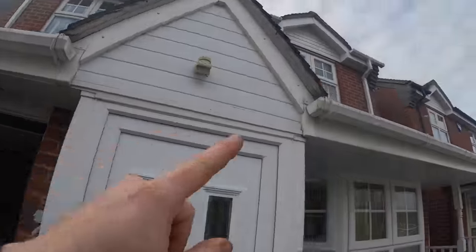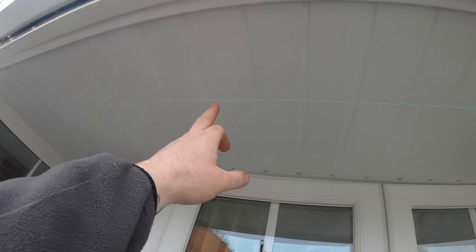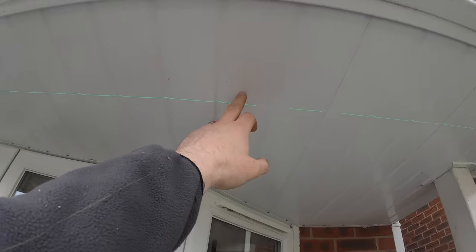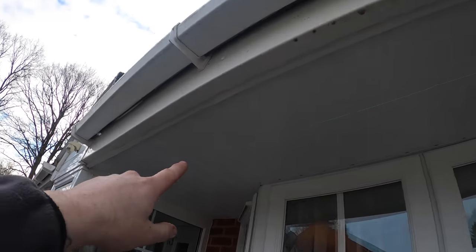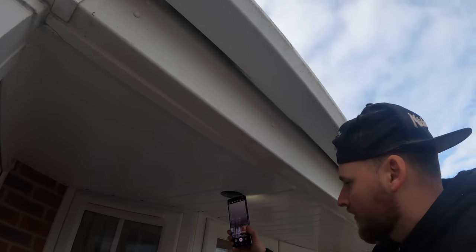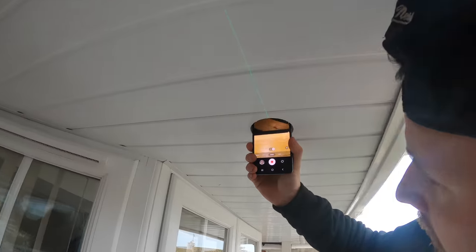What, just go for it? Yeah. We've done the same the other side, we've pushed the rods through now. Managed to get them through and you can hear them around here somewhere. So we've got centre of the window there, 31 inches off. So we'll get these drilled now and hopefully we'll see the rod coming through and then we can tape on the 1.5 and pull it through with it. Nice. So before we just start cutting, he's going to put his camera up this side now and just see if we can.